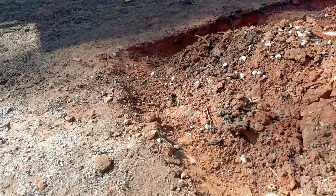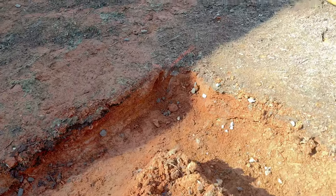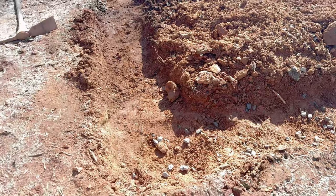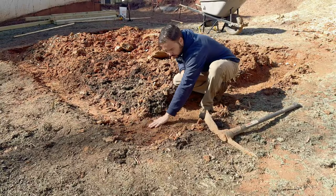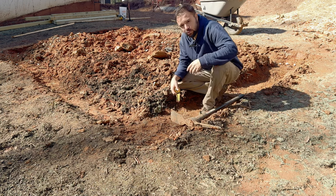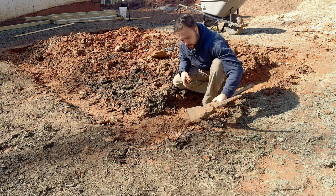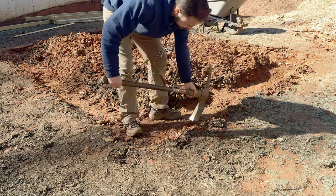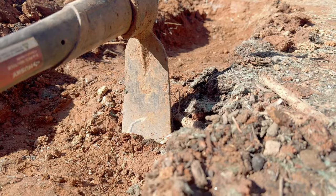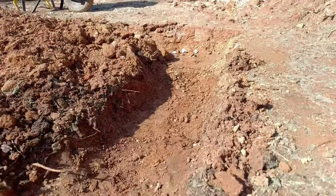After you've done your first pass at digging for your 4x6 boards, we'll set up batter boards and then start framing. You start at the lower spots and make your way up. A good trick I learned is that these boards are 5½ inches deep, so you measure 5½ inches on your pick and then start digging upward. As the 5½ inches clears the finish grade, you know you need to step up to another level of digging.